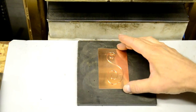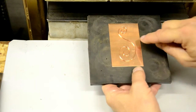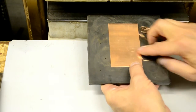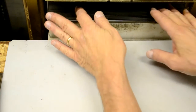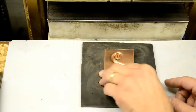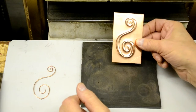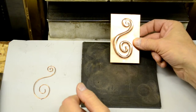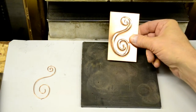First we'll do a little demo of the embossing technique itself, which is simply to put your target metal in between the urethane pad and the forming component. We'll run that up — 5 or 10 tons will do it. So that gives you a nice bumped up piece there. The thinner the metal you use, the more crisp that is going to be. This was probably 24 or 22 gauge, so it's a little mushy looking there.